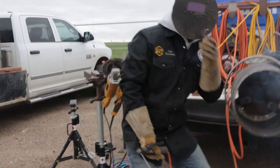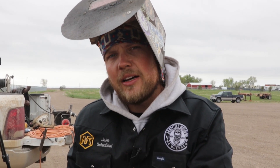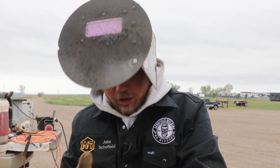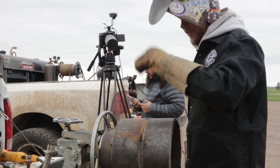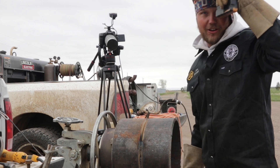Get over there so we don't short-arm ourselves, then we're going to start working on the tight side. On these tight sides there's a technique called softening the landing. Basically, you're so tight that you can't get a root in there, but you've got a landing in there. The whole purpose of a landing is to hold heat so it doesn't blow out and ruin the bevel. What we're going to do is grind away some of that landing, make it thinner, so the root can cut in and actually get all the way into the pipe. I just ground this a little bit to soften it up. I'm running the remote since I'm a one-man band right now — you really want a lot of movement so when it gets real tight you can crank it up.